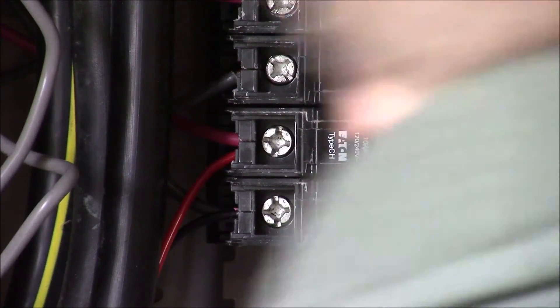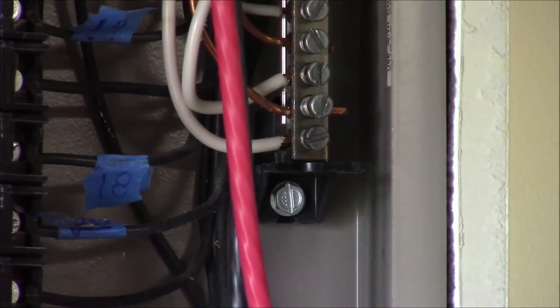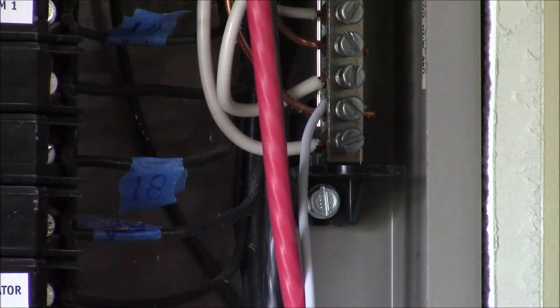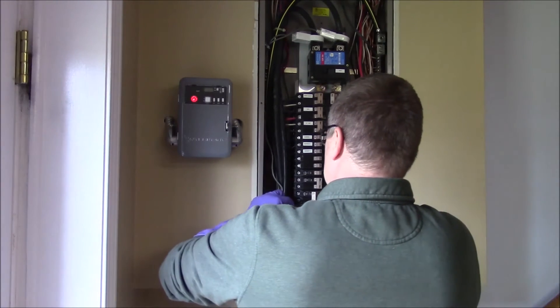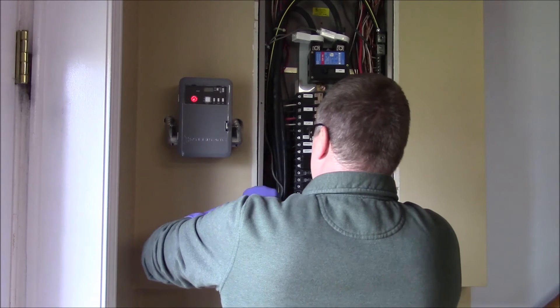You can see they're in there — you can tighten up those screws pretty tight. There aren't any empty places for the neutral wire on the bus bar, so I just attached it to one there. Then I cleaned it all up with some tie wraps just to keep it all out of the way.